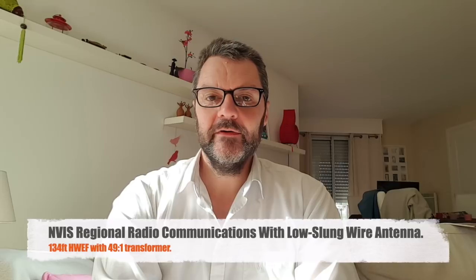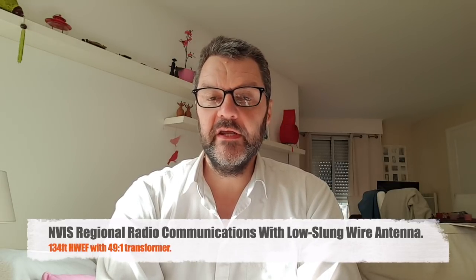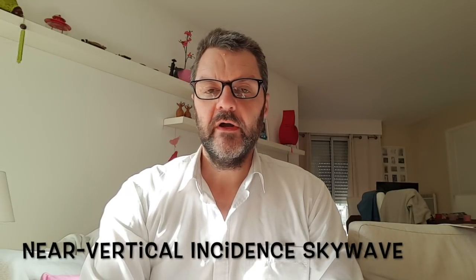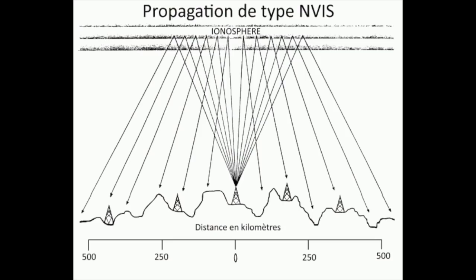In this video, we are going to see how to cover the regional range of radio communications, probably the most difficult. And for that, we are going to use a low-slung horizontal antenna. This method is called NVIS, or NEVIS, Near-Vertical Incidence Skywave, where your signal is beamed straight up, refracts on the ionosphere and rains back down, covering a regional range from 100 to a few hundred miles.